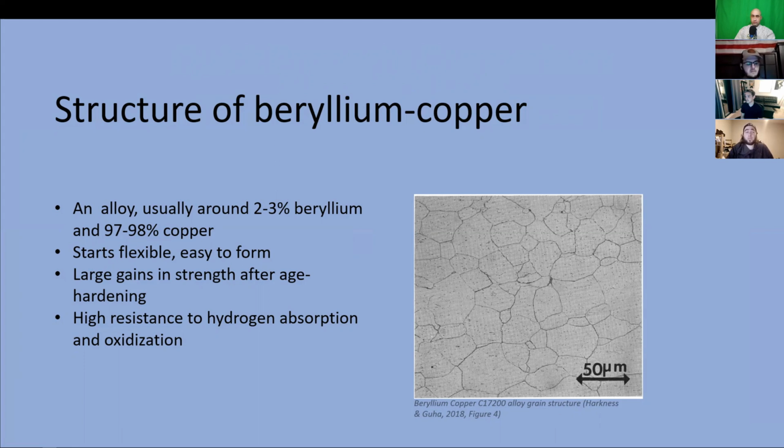There are two types of heat treatments used in the overall processing: solution annealing and age precipitation. First, the supplier melts pieces of beryllium into molten copper to ensure the beryllium atoms are evenly distributed throughout the copper. The temperature of the mixture is kept no higher than right at the solidus line, and both the temperature and time are tightly controlled throughout the process.